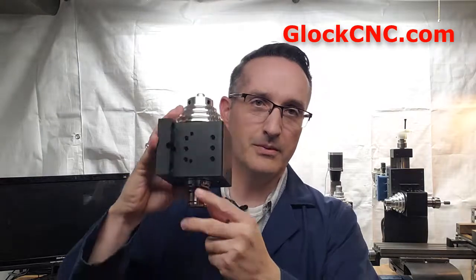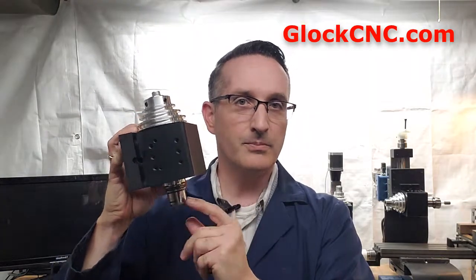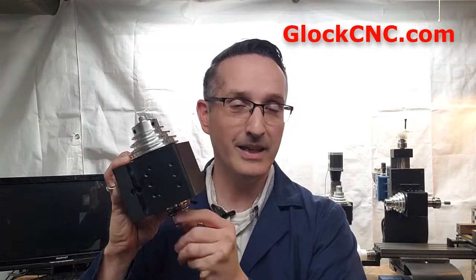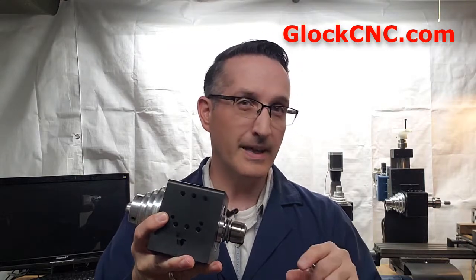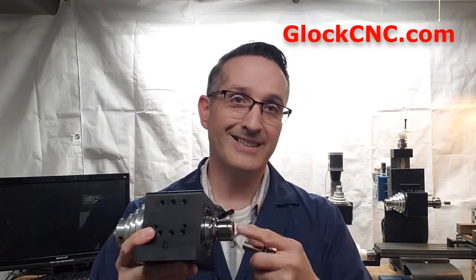One of the things everybody finds to be a pain is that with a typical mill or router headstock, if you've got a fixed ER headstock you've got to use two hands with a wrench to loosen it up, and sometimes the cutter falls out onto your workpiece or the floor. With tooling like this you can just pop it right in and out very fast. All you need is a quarter-inch cordless impact and a socket adapter — just zip the tool right in and out. Tool changes happen in about five seconds.